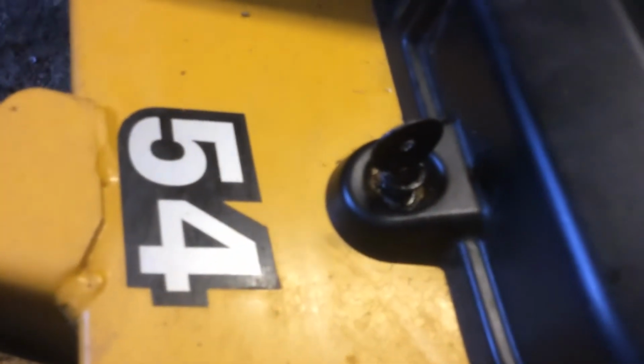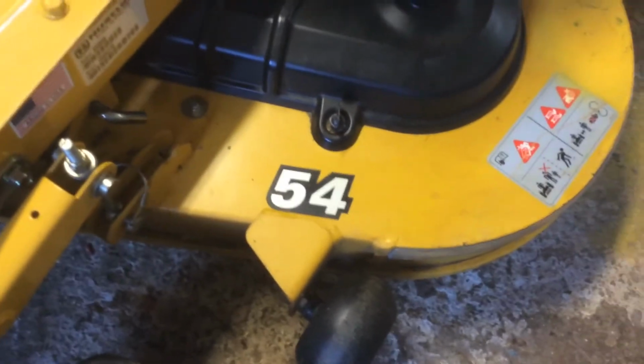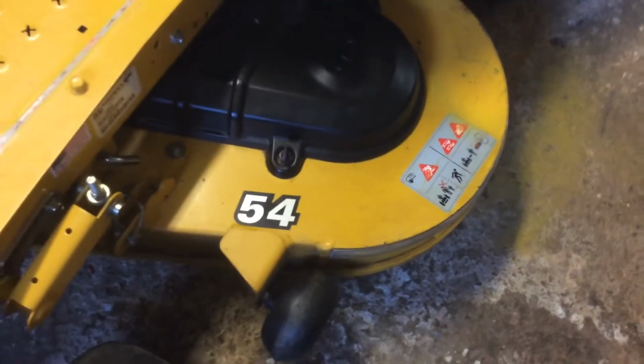And I put these little things here on here. I don't know if you can see it. I'm not looking at it very well. What it is, it's a regular screw, and I welded a washer on, ground the top of the washer down flat, and put it on a screw and welded it. So I made a quick release. I got them on there at a time. Oh, I can't get one loose now. I got it too tight. Maybe it rusted a little bit. I might kick it apart, but it'd still be quicker than getting the ratchet and the socket out.